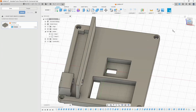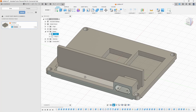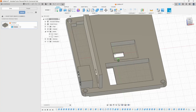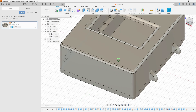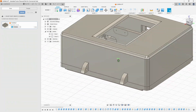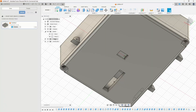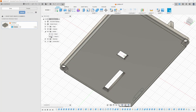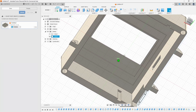Then the battery would sit on top of everything, while the microcontroller would slide and stay sideways in a nice slot to the left of the battery. On the body of the watch, there are two extruded mounts that allow for spring-loaded metal rods to help mount the watch strap so it can actually be worn. As for the screen, it would be secured from the inside after being aligned — and by secured, I mean hot glued. Finally, to the left of the casing is the charging port and switch.